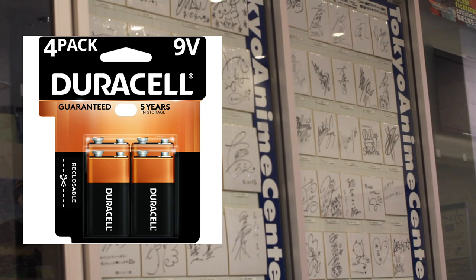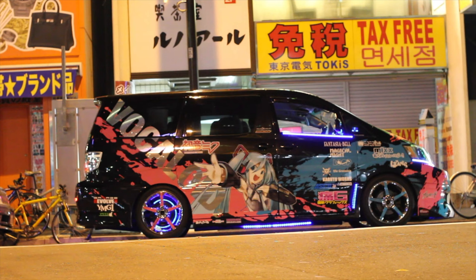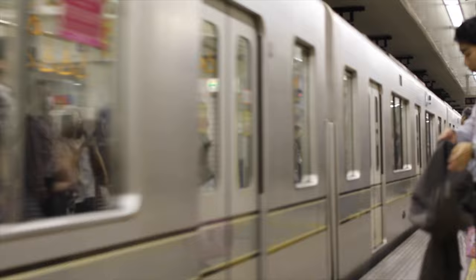It requires two 9-volt batteries to power both the transmitter and the receiver. Get this if you love eating through batteries and hurting the environment. All wireless systems today use rechargeable batteries. The transmitter and receiver use a VHF band which is like an FM frequency — the signal ranges from 169.445 megahertz to 170.245 megahertz. The sound, as you can hear, was passable, although not great, and it is subject to interference sometimes. Today everything uses a digital transmission.